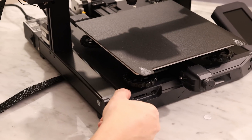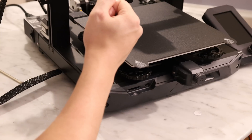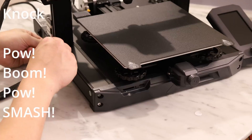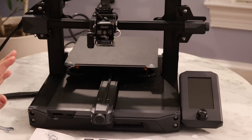If your printer isn't level, you can loosen these two bolts and give it a couple taps, then tighten those bolts back down. Overall, I'm pretty impressed with the build quality on this thing. It's a lot better than most of the Ender 3s I've worked with in the past. It seems like Creality is on an upward trend in terms of quality and features. Now it's time to turn it on and do some final calibration before we start printing.